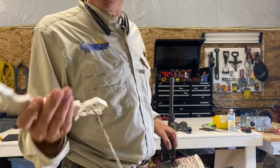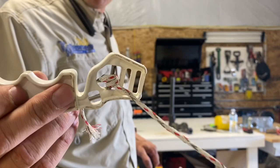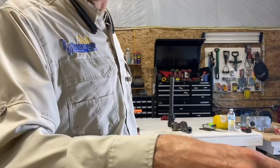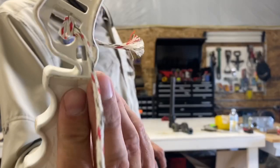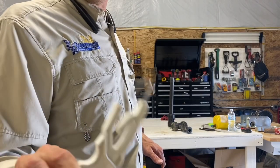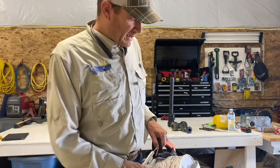These are Zammer handles — one of the handiest things. You can either tie the wire directly onto the metal part of the handle and it'll be hot when hooked to the fence wire, or if you put it on the plastic part you could hook it directly to barbed wire and it wouldn't be hot and it wouldn't ground out. Really handy little handles — these are called Zammer handles and they're really cheap.